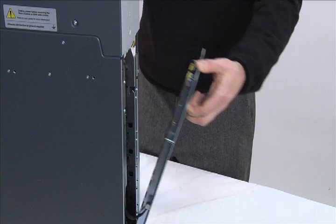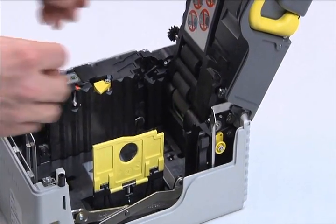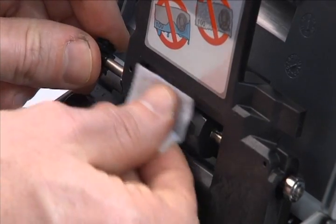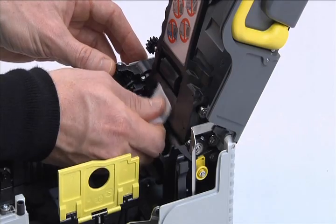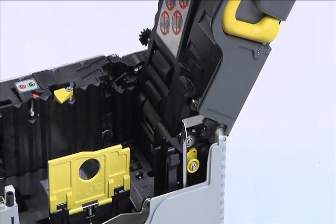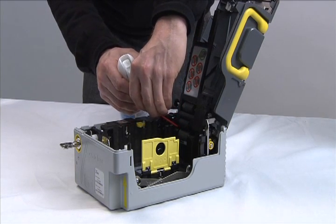Depending on the quality of notes used, the BNR loader may require occasional cleaning using alcohol wipes to remove residue from the rollers. Begin by opening the loader module, then lift the detection plate and push the pressure plate down. Clean the loader rollers with alcohol wipes, changing out swabs as they collect dirt. You must clean all three rollers. Start with the top roller — accessing the entire roller surface requires manual rotation by turning the adjacent gear. For the second roller, apply force by pushing down with your thumbs and apply alcohol swabs while rotating. The third roller, located between the other two, is rotated by turning the yellow knob — apply alcohol swabs and rotate as necessary. Spray between the second and third roller towards the back of the module.